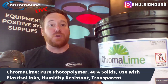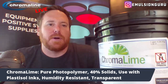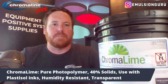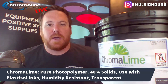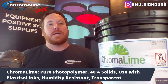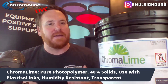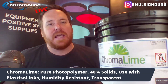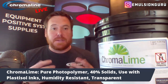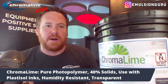We've tested Chroma Lime in a humidity chamber at almost 100% humidity — very high, probably low-to-mid 90s percent humidity — and we went to expose screens and the film came right off. Whereas with a lot of other pure photopolymers in that humid environment, you would have the issue where films are sticking. With Chroma Lime, you don't have that issue. It is lime green in color, and because of that color it's very transparent, so when you put your screen down and you're trying to line up your job, you can see through that screen very easily because of that transparency.